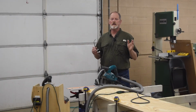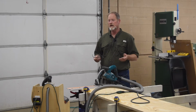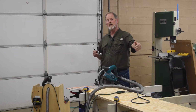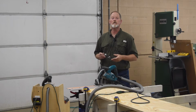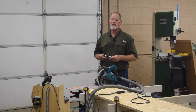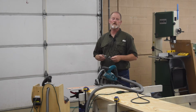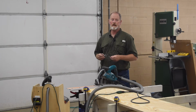I've cut all my pieces to width. What you see here is one of the fronts or the backs, depending upon where it is. And this panel will be cut to 70 inches long. Now what's left will be cut to 21 inches long, and that's going to end up being a side. And that's exactly what we want. But we always start on a piece of plywood. We're going to trim the edge off here to give ourselves a good clean cut. That factory edge isn't worth having.